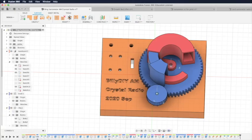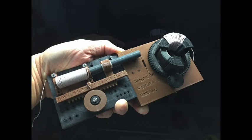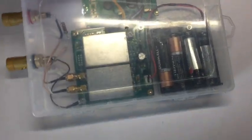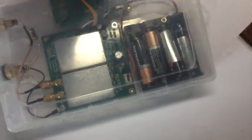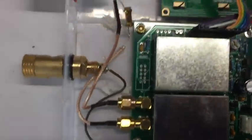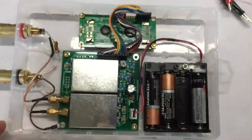Earlier this week I created a 3D design for the variometer radio using the ferrite ring. I got a few inquiries about how the Q-factor looks for the ferrite ring variometer versus the straight-line ferrite rod variometer. So today I decided to do a Q-factor test using this Q-meter that I got from China. It's a DIY Q-meter made using the ring-down method to measure the Q of a coil and capacitor combination — basically the Q of the LC resonance circuit. To do the test you need to hook up a capacitor as well as a coil, and the Q-meter will tell you the resonant frequency and the Q-factor.